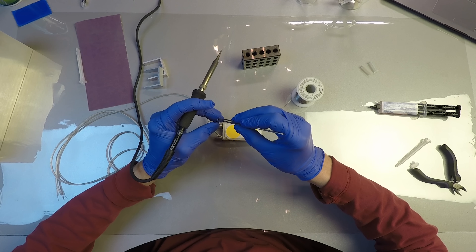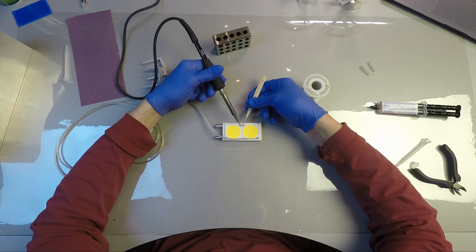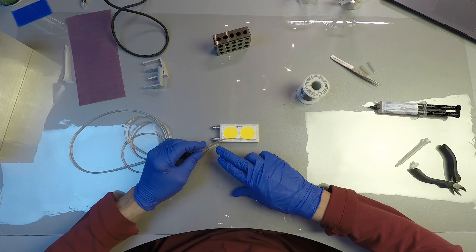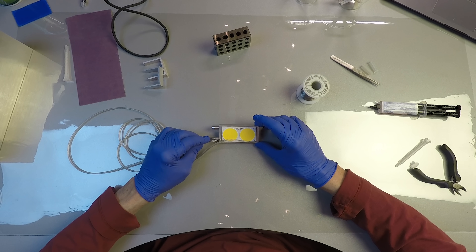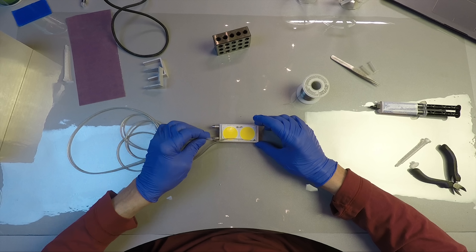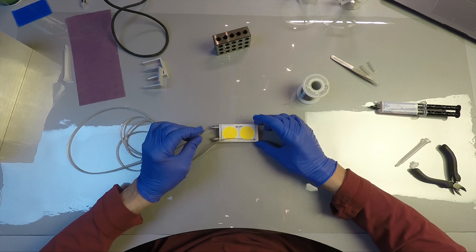We need to make sure that this is going to stay within the box, and this will get the two in series. We're going to make sure the polarities on the two wires are appropriate, because this is the positive and we can just check with an ohmmeter to make sure that this positive corresponds to the appropriate lead as we put it into the power supply, because you don't want to invert the polarities — it can damage the LEDs. And that's something we'll do before we put the final case on.